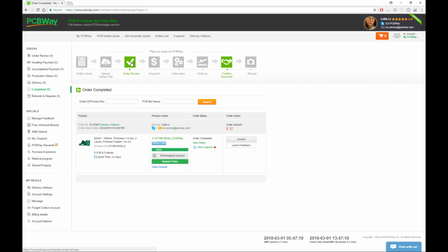If you're a newbie like me and you don't do very good PCBs and you miss stuff, this order works because it means they will go, hey, by the way, we haven't started fabbing this. There's problems. Let's fix them before you pay. Whereas if you're a professional PCB designer and you don't need them to do this auditing check, this is a hassle, because especially if it's a very complex PCB or design, you're wasting time waiting for somebody else on their side to check your work again and go, yep, it's good, give us money. So if this is going to be a deal breaker for you, that's just something to be aware of. You may have delays because someone is going to be reviewing your PCB files prior to payment.